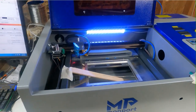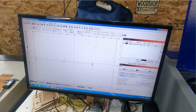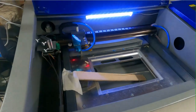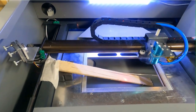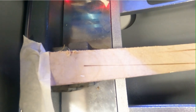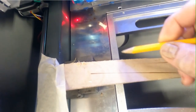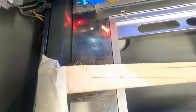The first one we're going to do it on is the Monport K-40 — it's kind of a small laser. I already have a line set up in LightBurn to burn, so we're just going to burn this. I've got a pencil here too, which helps. You'll notice what you want to look for is the narrowest part of this line — to me it looks to be about right there. Once you get that, you don't want to touch anything, and you want to move your laser head over top of that.